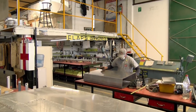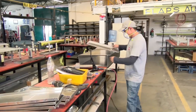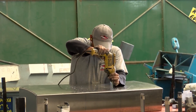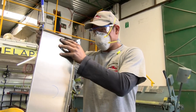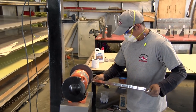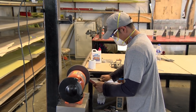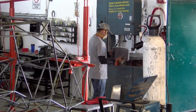The fuel tanks that go into the wing are made from 050 5052 H32 aluminum, both the tank skin and ribs. The ribs are formed over form blocks and then fitted into the bent tank skin. Then they are drilled together then riveted using soft weldable rivets. After riveting, TIG welding is used to weld all the edges, seams and over the rivets. The interior ribs have their bottom corners cut off so the fuel can flow but they act as a baffle to keep the fuel at the inboard low point of the tank. The inlet filler neck, outlet flanges and drain flange on the bottom are welded on last. Finally, the fuel tanks are pressure tested for leaks.